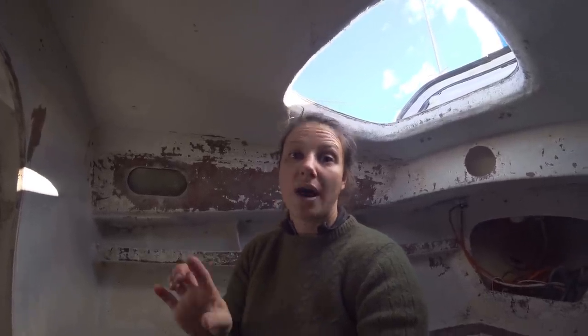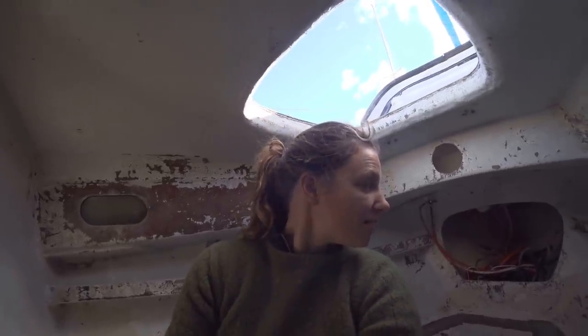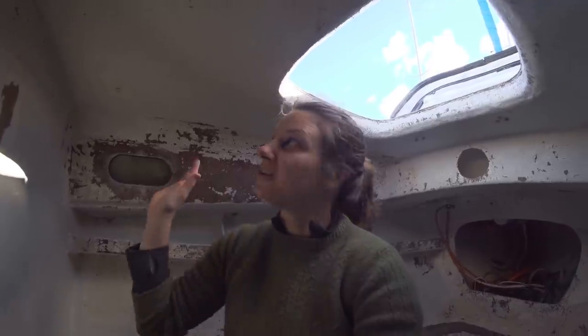And just before I wiped everything down, I did a vacuum too. So we're pretty much ready to paint now. I'm just going to go around with a paper towel and wipe down the surfaces that look a bit damp, and then I'm going to put the heater in this room for maybe 1 or 2 hours and have a little break and do something else. So what's left in here is dry, so that when we put the primer on, we've got a dry surface.